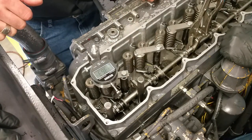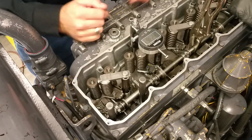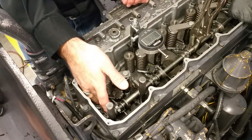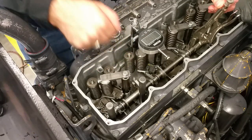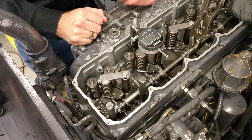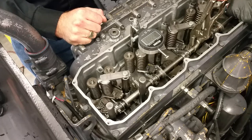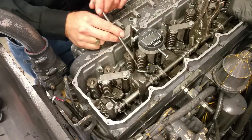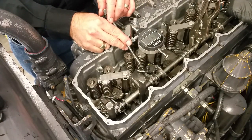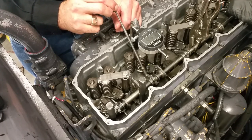Now we've moved over to number two, and we know that number one is held open 3.63mm. We have to zero out number two — we always zero against the shutoff, then let it go. I'm not letting this go slowly because I get a different measurement; I'm just letting it spring back wherever it wants to sit. It's fairly consistent. Now I take my tool and readjust this until I get to my 3.63 — it's a pretty delicate adjustment.